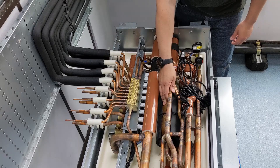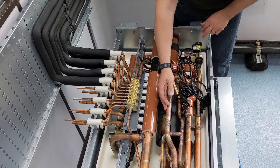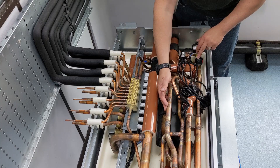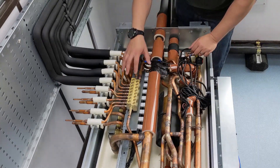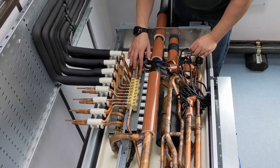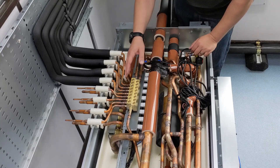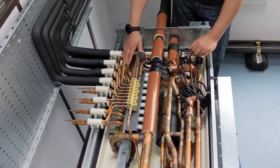It's not really acting as a gas-liquid separator at this moment because we've only got vapour coming in. So we take the vapour off the top — LEV1 in this situation is actually shut because we're not needing to take any liquid refrigerant off. We send that refrigerant the opposite way through the indoor units. I've got a set of control valves in here: A and C are going to be shut when we're doing heating and valve B is going to be open. We send that refrigerant off to the indoor units that need heating.